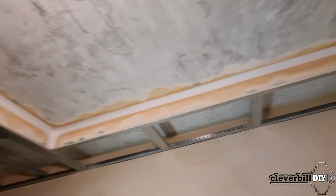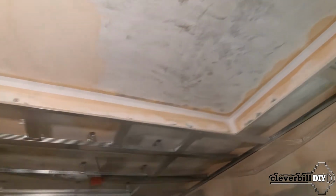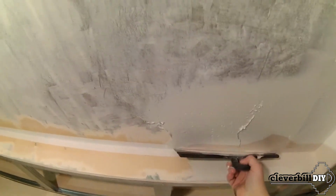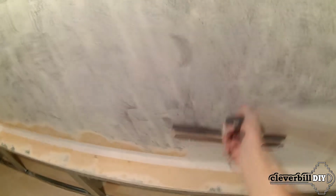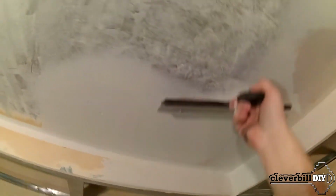After sealing the joints of drywall with a concrete ceiling and gluing paper tape on them, I cover the concrete ceiling and vertical parts of the gypsum board with putty, using polymer finish putty. In 2 layers, with intermediate drying, I cover the concrete ceiling of the first level with putty.